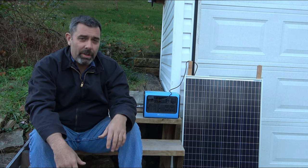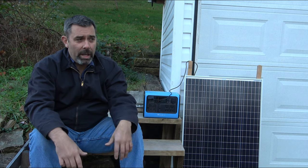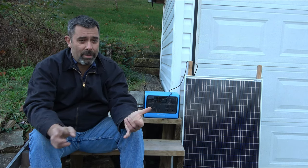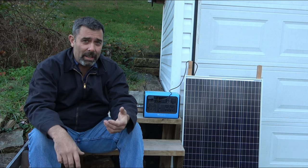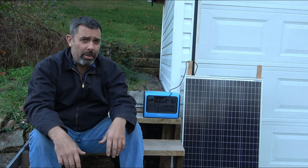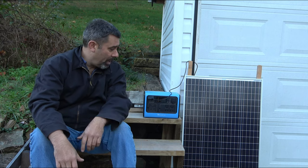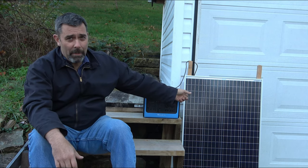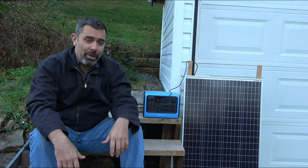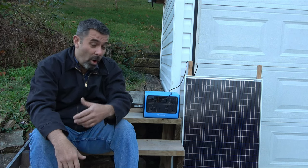There's a lot of opportunity to have reserve power. If you're talking about a camper — you won't be able to run a microwave with this thing, but 700 watts will run fans all night long, run every light in the place, and will run the water pumps and things like that. So you can do everything pretty much but heat up water or use a microwave. And that's a pretty awesome amount of power available. Put two or three or four solar panels on the roof and you've got a lot of juice rolling through there.